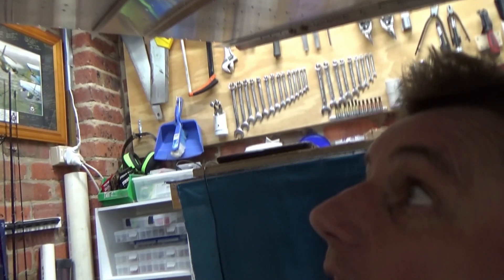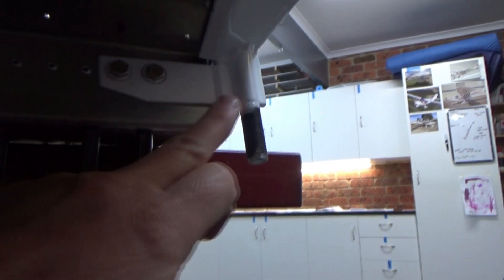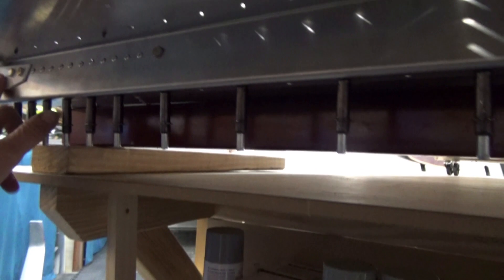I'm going to rivet the gear channel under the fuselage. Slid the aircraft forward on the bench and I'm working on my backside tonight — good chance to have a look underneath. Probably should start prepping for paint down here as well. For those unfamiliar, this is the external of the aircraft — all this stuff will hang out in the breeze. The stiffeners are on the bottom sides of the fuselage. You can see the landing gear attachment bracket with the doubler on both sides and the clecoed holes where I'll finish off the gear channel.